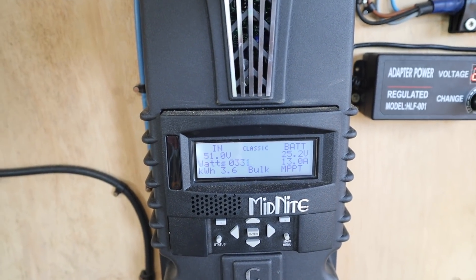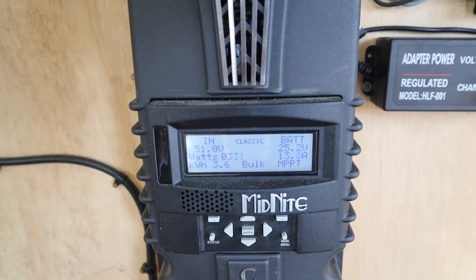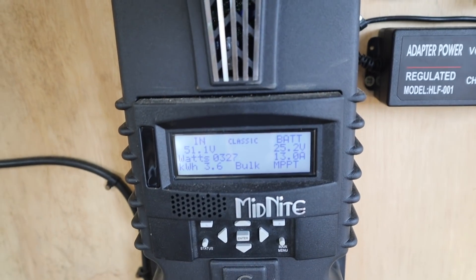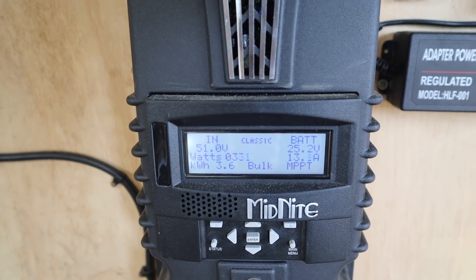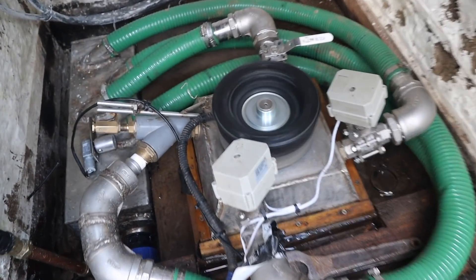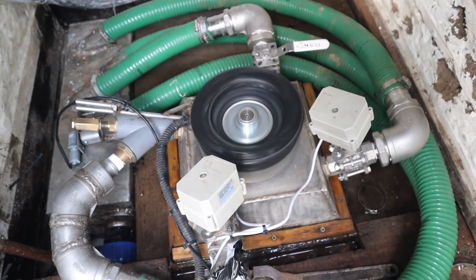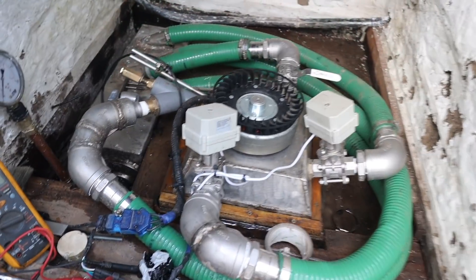The reason it doesn't use that much is because it's not spinning very fast on my turbine. If it had a higher RPM the losses would go up because wind resistance is squared with velocity - if I doubled the RPM that figure would quadruple. But you can see it doesn't make a huge amount of difference. There's no air moving through that I can feel - it really doesn't make much difference at all, so I'm going to take the tape off and not worry about the fan.